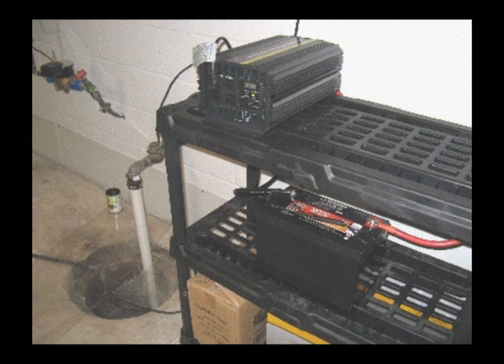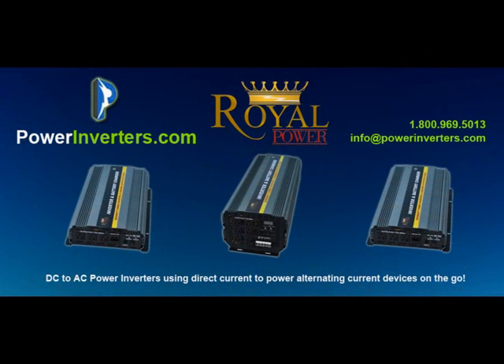As soon as the power is lost, it'll switch over to battery power, and then back to utility power when the power kicks back on. This is an ideal setup for a submersible pump if you don't want to encounter any flooding. The submersible pump gets plugged into the inverter and runs off utility at all times. What you'll want to make sure is that you have enough battery power in reserve based on how often or how long you lose power. I always suggest doing a simulated blackout to understand exactly how much power you have and how long it'll last before the batteries are dead.